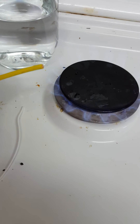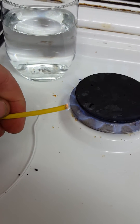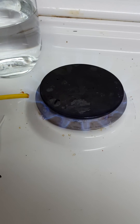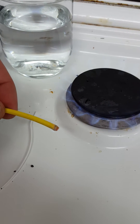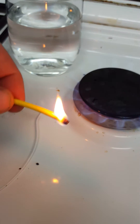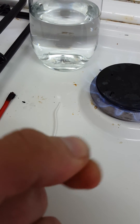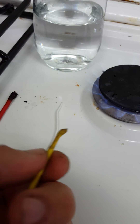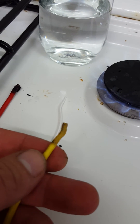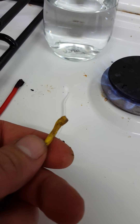So on to the TPE. It does burn — it's not completely fire-retardant — but it extinguishes with relative ease. The key thing about TPE is that although it will burn, it maintains its structural rigidity. You can see it's still round, and if I extinguish it, it's still kind of integral. It doesn't fall apart; it's stretchy. The cables would not short together at this point because it's still insulated. So TPE has a significant advantage over PVC.